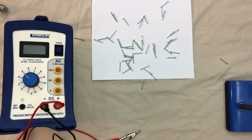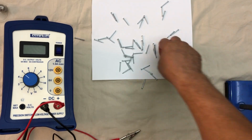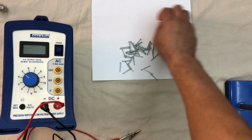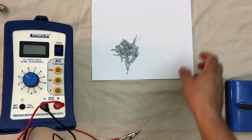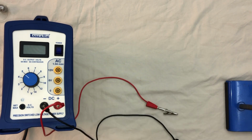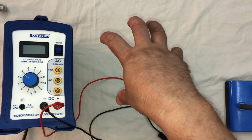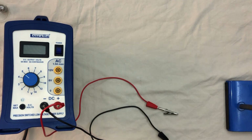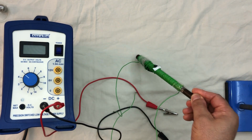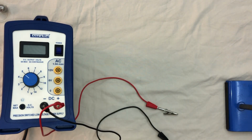Now hopefully most of you, or even all of you, found the first application of that would be as a junkyard crane. Junkyards are where cars go to retire when they're scrapped. Rather than picking up the scrap cars with a crane with a claw mechanism, we just simply use a very strong electromagnet which can pick them up, because cars usually have quite a high iron or steel content, and they can drop them by turning off the electromagnet.